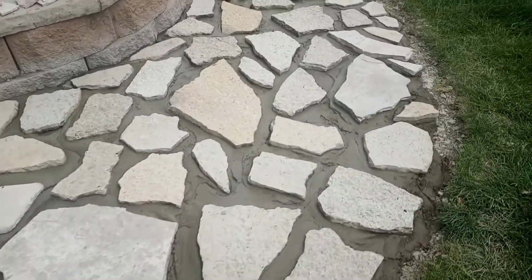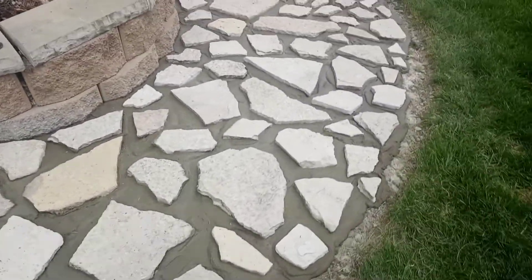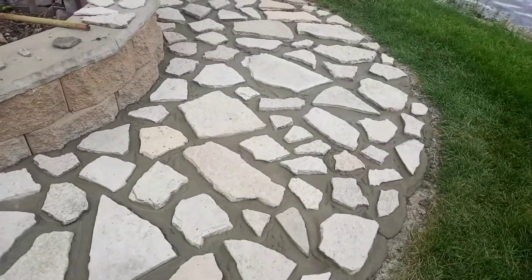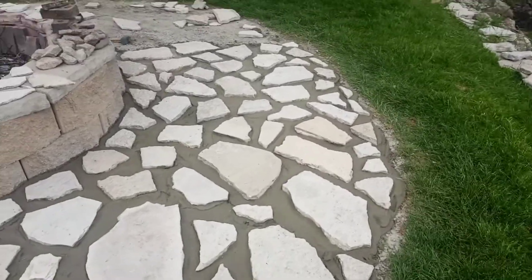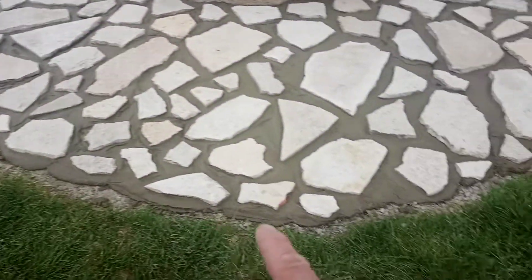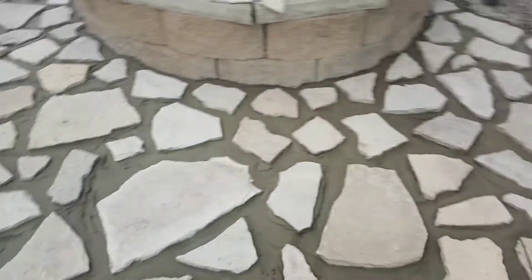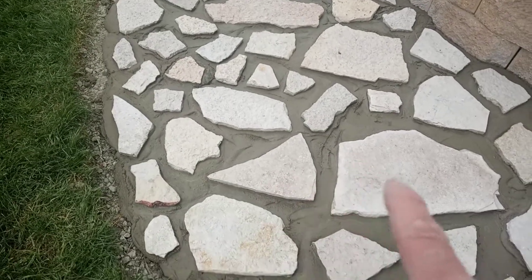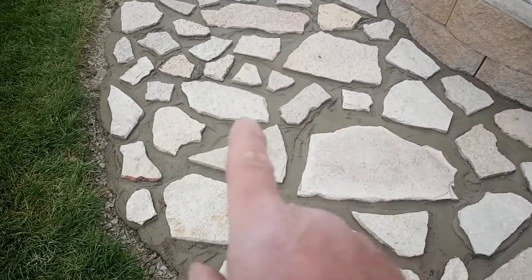This is a structural mortar bed on top of ground cement stabilization, just to help things out. The flagstones are set in mortar with fiber mesh in it, and we have to come back with a special grout and grout all this in.